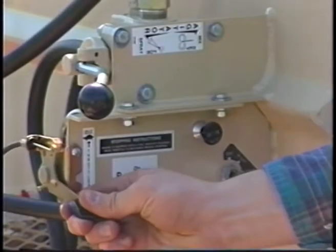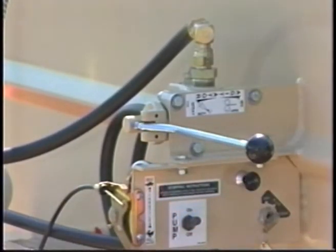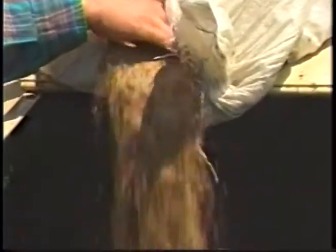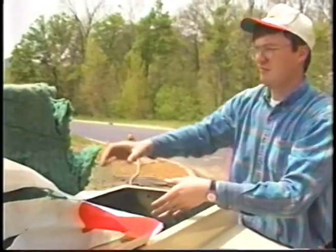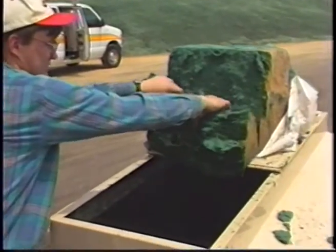Replace the gasket into the remote valve connection and continue filling the unit. Increase the RPM to full. Ensure that the agitator control is in the reverse position for mixing. Now you may start loading the seed and amendments, lightest ingredients first. Quick swelling seed should be added just prior to application. Add fiber mulch by dropping the suggested amount for your load into the mixture, sections at a time. The mulch should be fully loaded by the time the water is at the three-quarter mark.